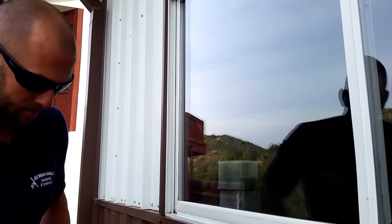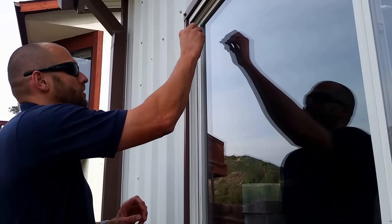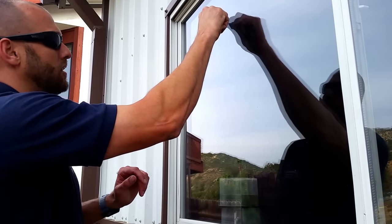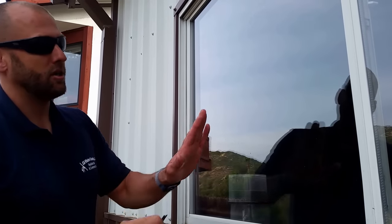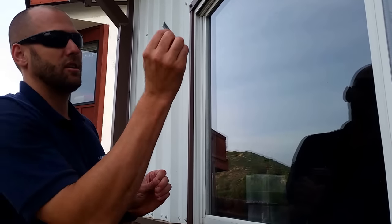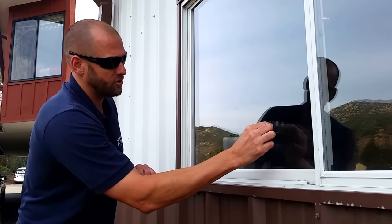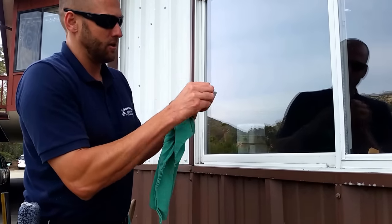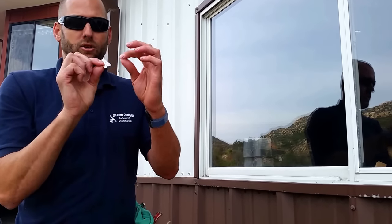That mark is kind of stubborn, so I'm going to just flick the steel wool down and let it go to the ground. This is where my little wrist razor comes in — last resort. We don't want to use this all the time. If someone ever tells you that you scratched their windows, just tell them we only use this for small little marks. Just barely touch the window. If I need to scrape a lot of marks, there's a little mark there and it doesn't leave any residue on the window. If I'm going to scrape a lot of marks off the window, you're going to want to re-wet the window and do it while there's lubrication on the glass. But just little marks like this, you can just touch up — straight direction only, don't go back and forth. Straight direction only. Wipe off the blade with a dry cloth — keep these blades really dry because they rust quickly, and if you keep them nice and dry, they'll last a couple jobs.